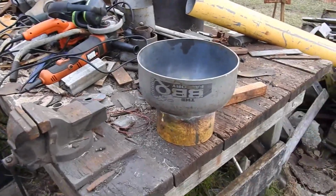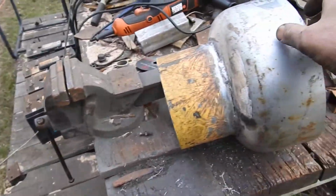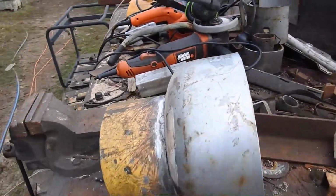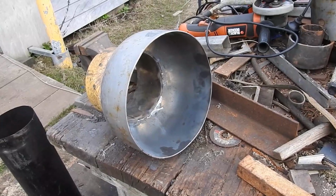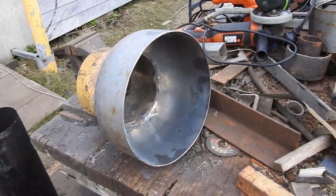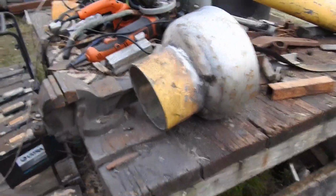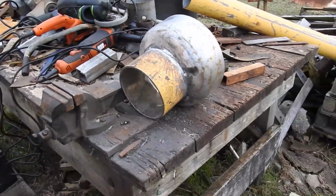It's interesting to observe that the new torrefaction system does seem to be paying off, in that the fuel in it stays dry, whereas in the previous arrangement the fuel was becoming quite wet. You could reach in and touch the fuel. It was like an Amazonian rainforest in there. Now I'm finding that the fuel's staying dry, and any moisture that's in it simply goes into the walls of the existing hopper, or the previous version of the hopper, thereby creating something along the lines of a moderator.